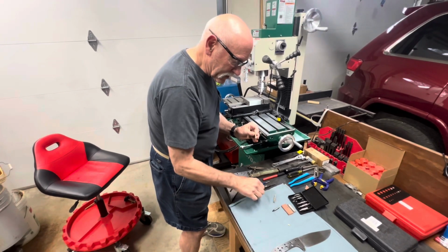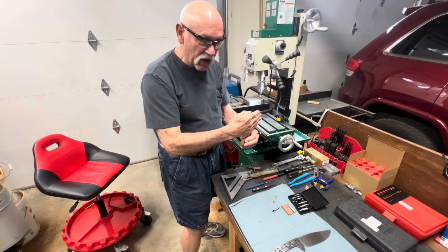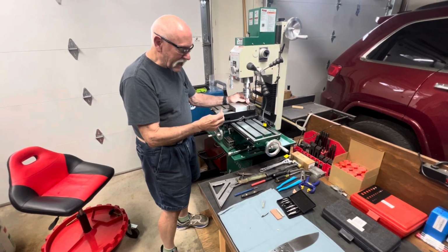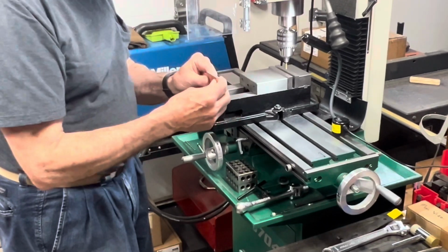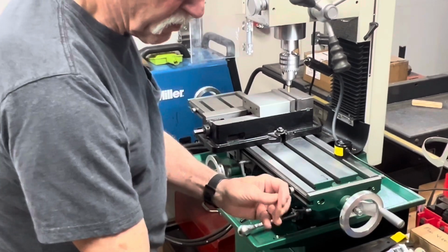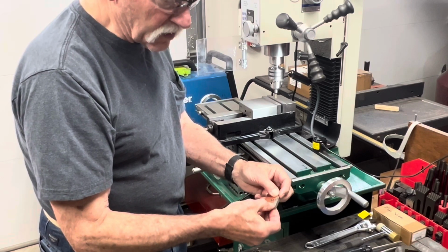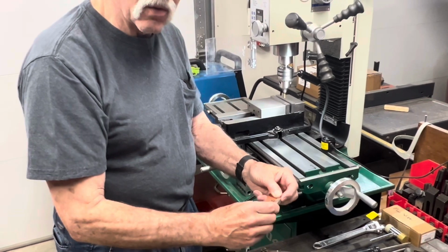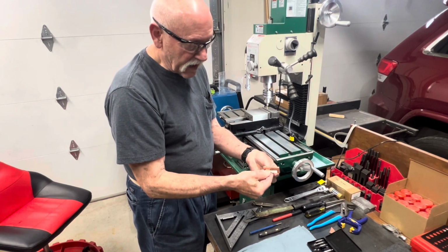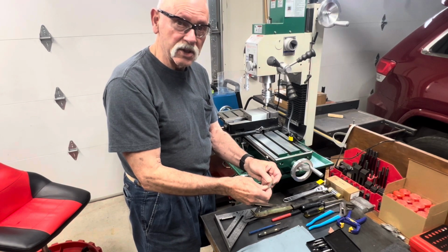But since I did not do that, I drilled the holes and they were not lined up on the line exactly. So I had to use a burr, which I set down into the hole, and then I moved the piece from end to end a little bit to oblong the hole. And that way, when I got these 2 pieces put together, they're movable, but I can work with that. I can center it when I glue, because I'm going to glue with epoxy and put epoxy into the holes and then put the pins in there, and even though the holes are a little oblong, they will still fill with resin and they'll still be pretty tight.